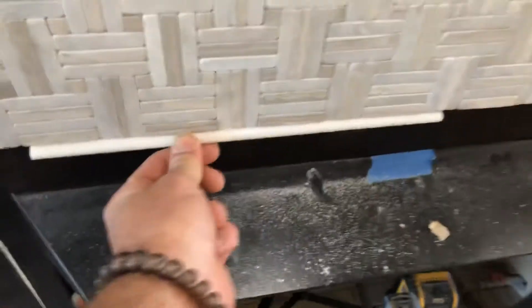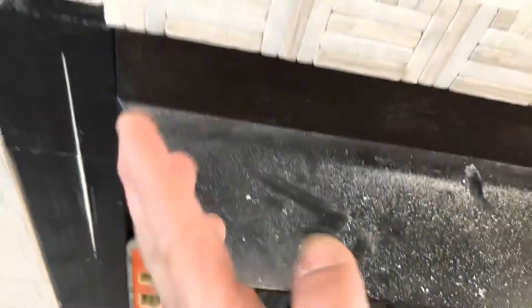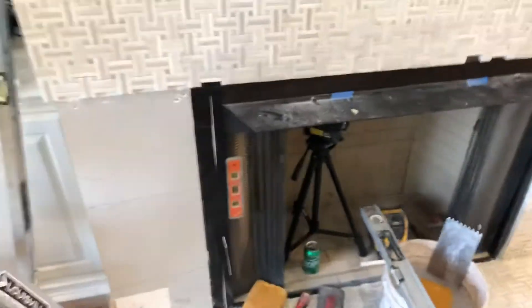There will be a marble pencil trim piece sitting right there to dress it up. My corners will be mitered — like the corner of a window frame where the wood is cut on an angle so it looks continuous, the pattern flowing around the corner. The inside of the stone will be cut at an angle and run down, so instead of just stacking pieces, the round profile of the pencil trim flows together seamlessly.